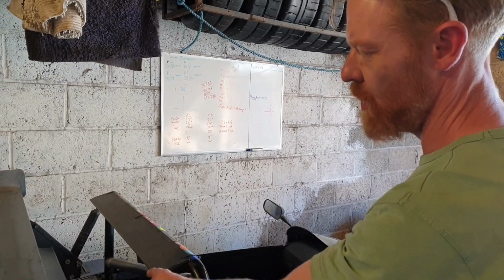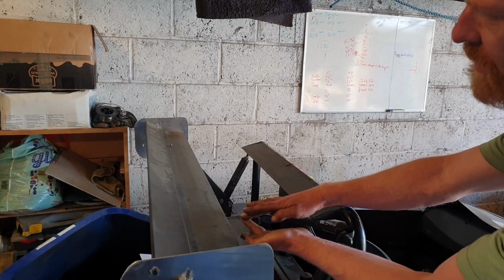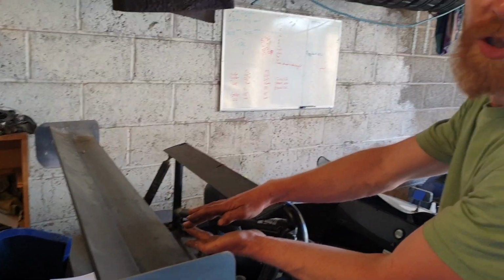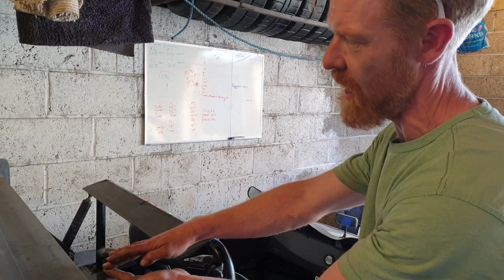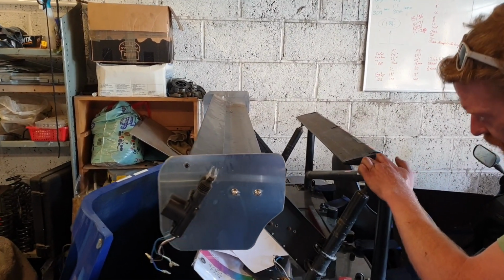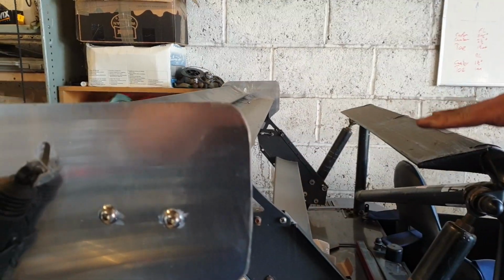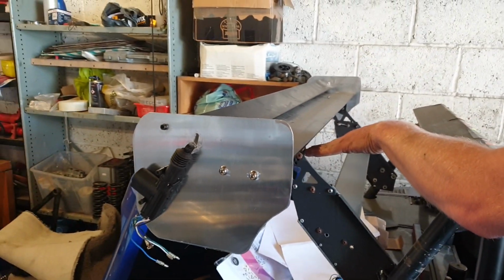With this piece on, it makes a converging wake, and by the time here, all the turbulence has largely reattached and sorted itself out. So you're actually getting clean air over the spoiler at the back. You can see that it's very slightly angled down, so that the flow of air should be hitting just under the wing here.